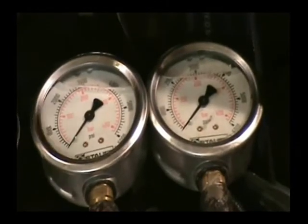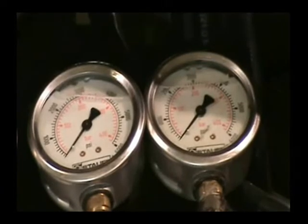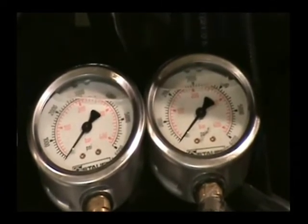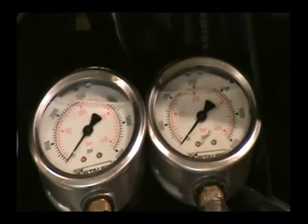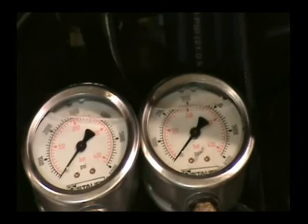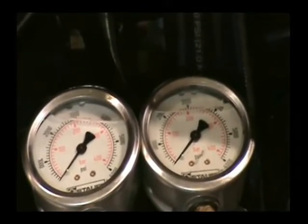That was your example of how when one gauge gets up to 2,500, the other gauge kicks in. That's your unloader kicking in. That's bringing it back into the circuit at full throttle. When you're doing this process, you need to ease the throttle pedal down. Take your time on it, just ease it on down as you see your gauge working up, okay?